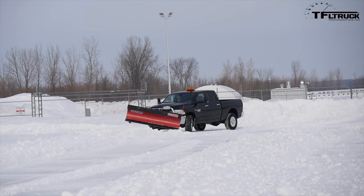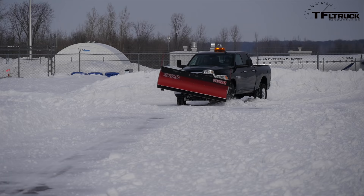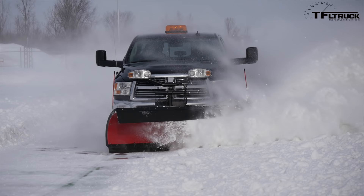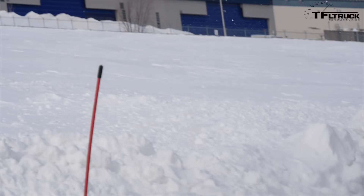It's going through. Now pick up the blade and stop. I want you to flatten out the blade and back up — use your right hand, keep one hand on the wheel. That's why you hold the remote with the extra fingers. If you're moving a lot of material or hitting heavy snow, you'll want to get some forward momentum before dropping the blade. That'll help you keep going and get work done quicker.